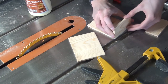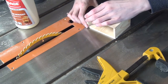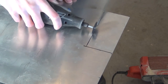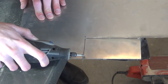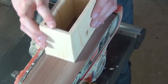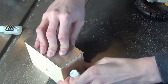I then just glued it all together. While the glue was drying, I marked out the front and back panels on a sheet of aluminum and cut them out with the dremel. Once the glue was done drying, I took the box to the belt sander to add some retroactive precision and ran over the corners. I then used some super glue to affix the front and back plates to the box, and then sanded them down to match up as closely as possible.